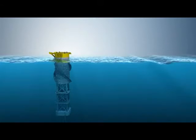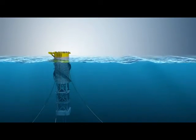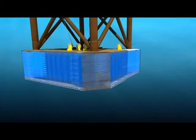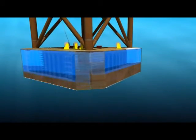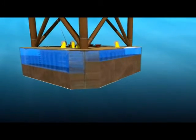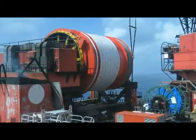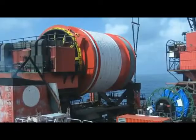The SPAR is made storm safe with the installation of the first three or four mooring lines. After the rest of the mooring lines have been properly installed and secured, fixed ballast is added to the soft tank. If polyester mooring lines are used, they can be pre-stretched at this point.